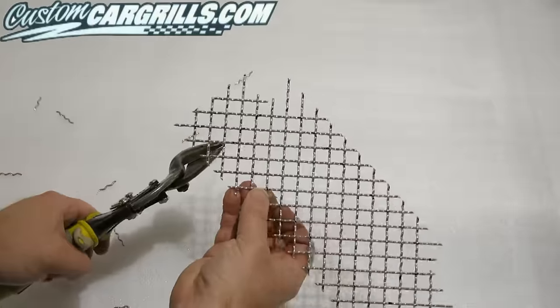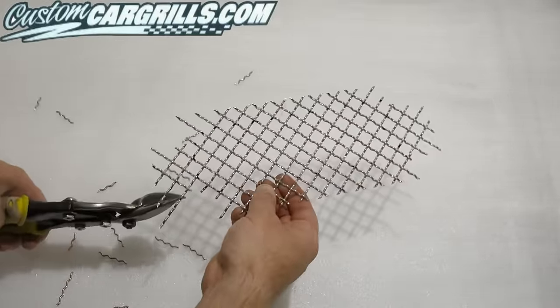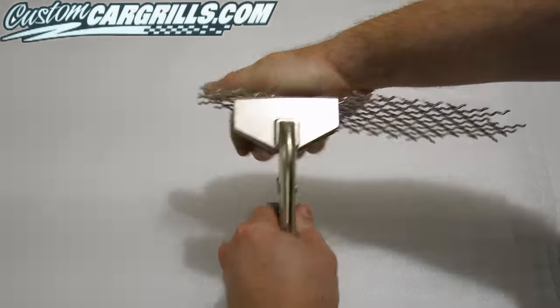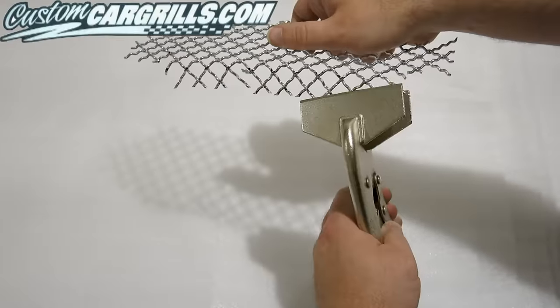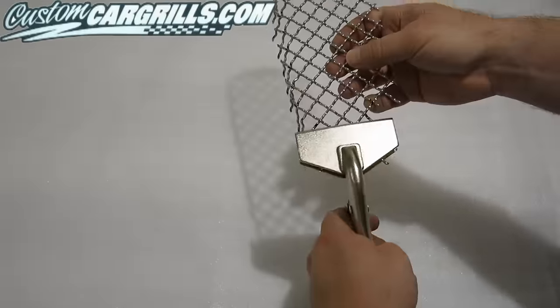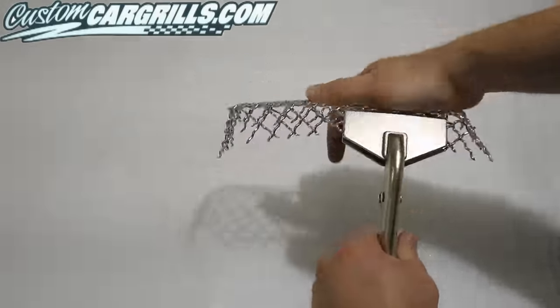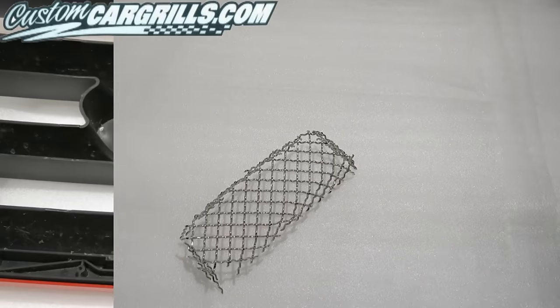You should also be cautious and mindful of the material that's fraying out of the sheet. Next, I'll be using a sheet metal vise grip in order to grab a hold of the material and bend it at roughly a 90 degree angle. Depending on the material that you're using, you may need to clamp and bend a sixteenth to a quarter of an inch past where you'd marked off, otherwise it's going to be too tight of a fit when you try and fit the mesh on.